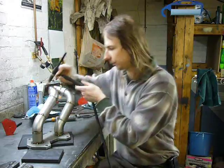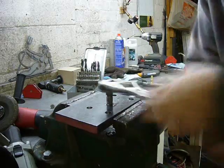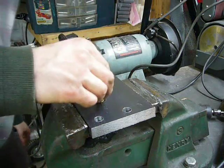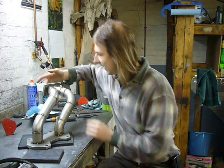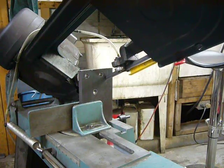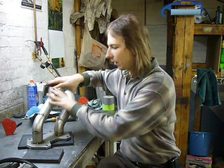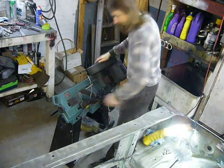the argon from the TIG torch, inside the tubing is oxygen. And when oxygen hits melted stainless steel, like would occur in a weld, it causes it to oxidize. It separates out and forms what we like to call sugaring, which is the stainless steel oxides on the inside of the weld. The problem with that is that it causes a brittle spot. So if it's going to crack, that's where it's going to crack. By displacing all of the oxygen in the tubes with a constant flow of argon, we can prevent that.